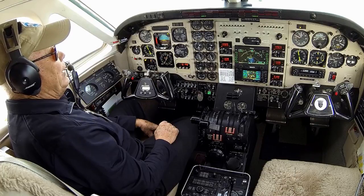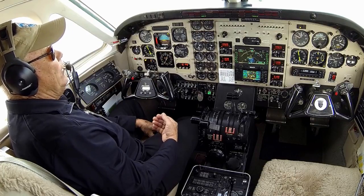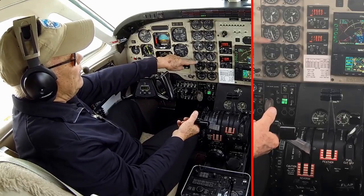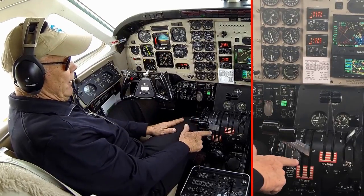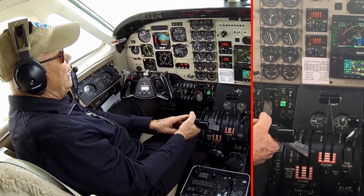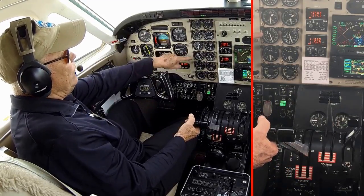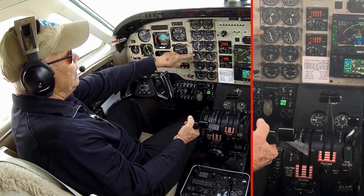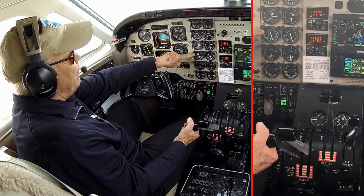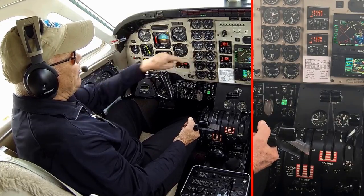Well, ideally, as soon as the blade starts going negative, we would leave low idle and have the fuel control start increasing speed of the engine. So I now want to see where that is. So remember, the F was where we got flat pitch position, it's left side. I continue back until I see the power start to increase, N1 go up. Notice the RPM going down. Blade's going negative, but we have not yet added power. Right there we pick up.